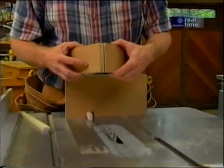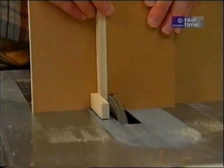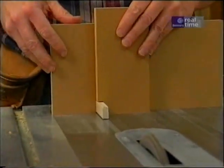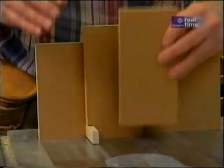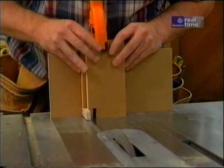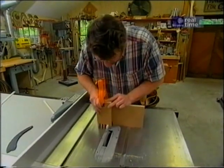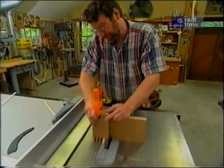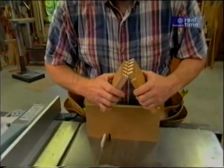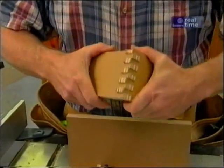Here are a couple pieces of scrap plywood that I'm going to join at the corner with box joints. The first step is to take one of the pieces and the gauge — which is the same width as the pin — put it up against the pin and make a pass. Now I remove this gauge, slide this piece over so that it's over the pin, take the adjoining piece, run it up against the pin, put a clamp to hold the pieces together and make the next pass. Now it's just a matter of sliding the piece over, dropping it on the pin, making a pass until we get all the way across. That's good — not too tight, not too loose. Perfect box joints. This jig is going to come in handy.